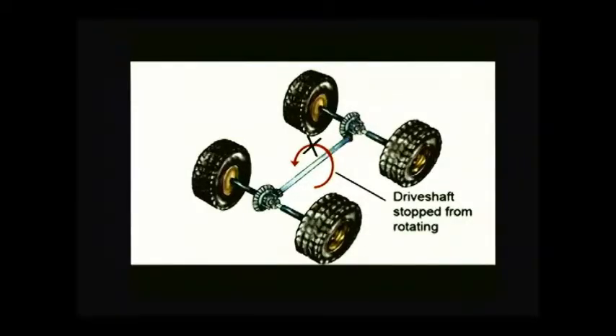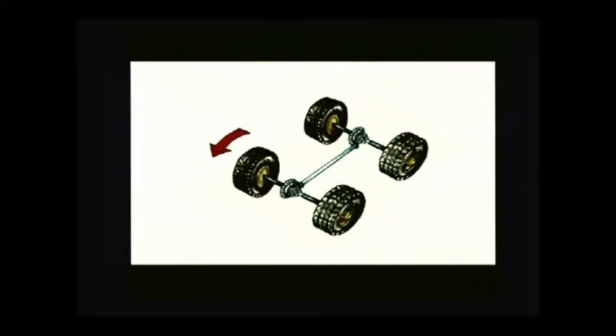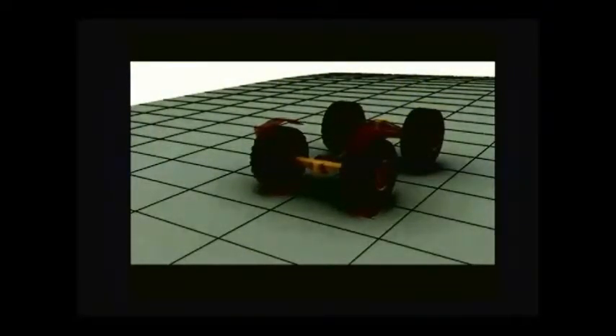This type of parking or emergency brake is found on various types of mobile equipment. Unlike the parking brake on most cars, a drive shaft disc type brake doesn't act directly on the wheel — instead it stops the drive shaft from rotating. With this system, the wheels are not locked. A non-locked differential allows the wheels to rotate in opposite directions even with the parking brake applied. Normally, the front and rear wheels counteract each other so the forklift stays in place, but all four wheels need to be on the ground with good traction. Here, the grade and excessive load caused the forklift to tilt forward so much that the rear wheels were likely off the ground, so the forklift rolled forward, pivoting and sliding down the slope.